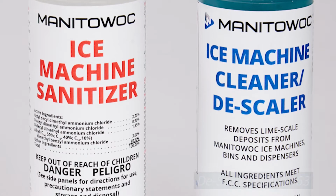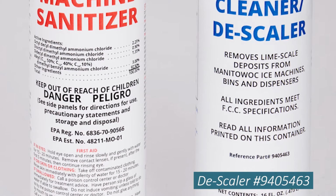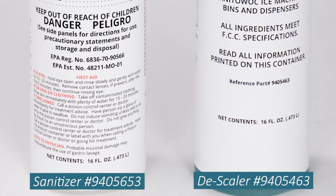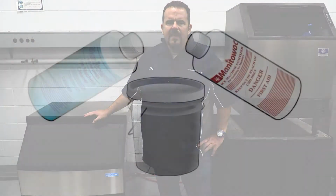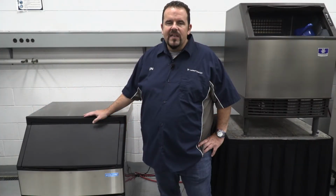Manitowoc Cleaner Descaler is part number 9405463. And Manitowoc Sanitizer is part number 9405653. When performing this procedure, do not mix descaler and sanitizer, since doing this will cancel each other out. Wear rubber gloves and safety glasses while handling ice machine descaler and sanitizer.